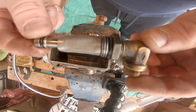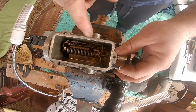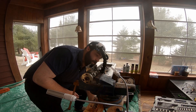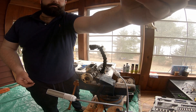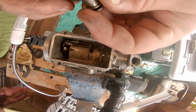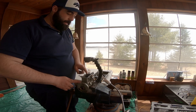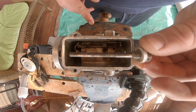Here we've got a screen — this is the inlet screen. This is the pin here that holds the governor spring in place, and it just comes out through the back here. There's a nice washer that apparently goes in there, and this is the pin. The spring comes out here, and there's this little piece on it that is supposed to pull the spring. We've now got the spring out as well as the little dry post that went in through there.